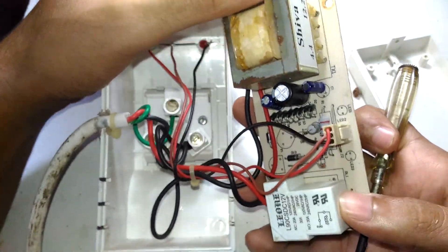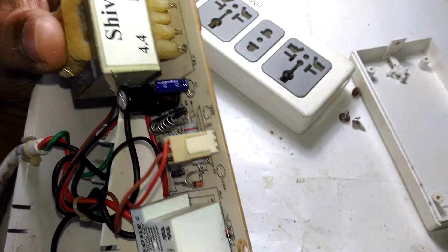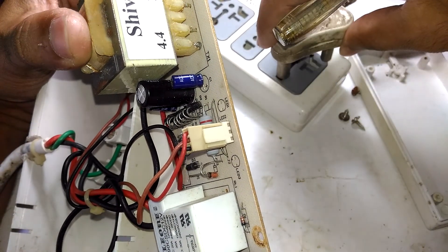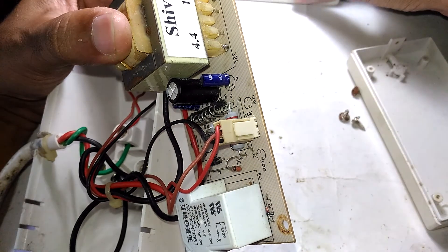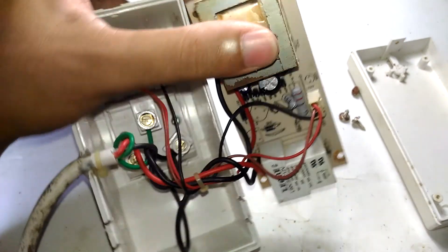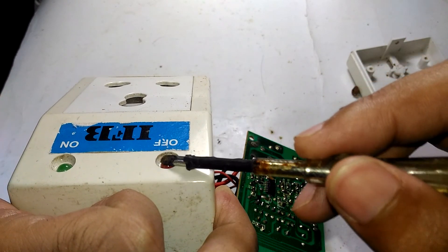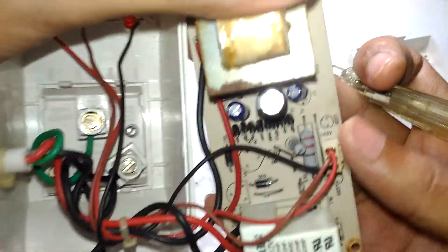Based on that logo, it could be an ST Microelectronics part — either an operational amplifier or a microcontroller, I truly don't know. There is a manufacturing date on the board reading the 4th week of 2011, so this thing is about 6 years old and still works. Unfortunately, the plug socket at my workbench doesn't support these 16-amp power plugs, so I can't demonstrate it live. If I could plug it in, after the five-second delay the indicator light would come on, and if it trips, the light indicates that as well.